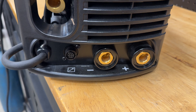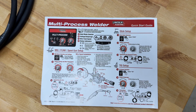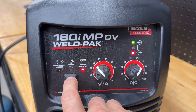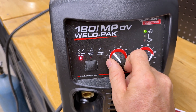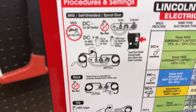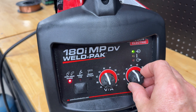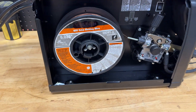While very simple to set up, there's some behind-the-scenes technology that automatically adjusts settings depending on what welding process you choose. One of my favorite things is the quick startup guide that comes with the machine. First, select your weld mode with a push button until the correct process is illuminated. Next, adjust your voltage amperage dial to match your process and material using the procedure chart inside the case door. If you're wire welding, now is the time to adjust the wire feed speed. The only time this dial functions is if you're doing a wire feed welding operation.